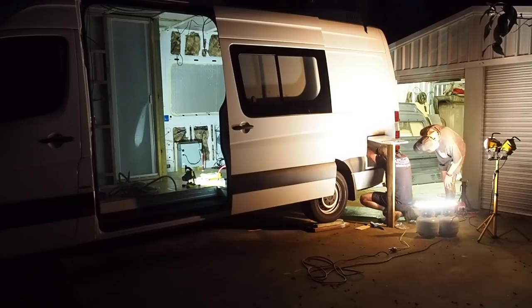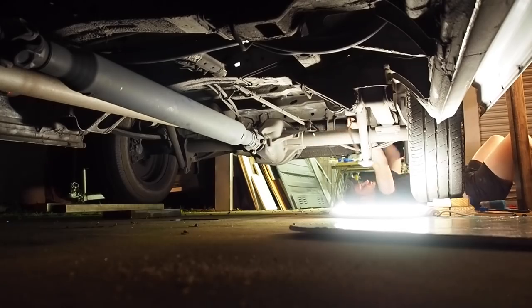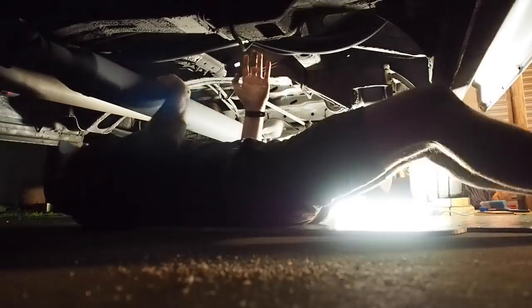So we're getting the holes ready for the pipe work and putting up the regulator. So now we're running all the undermounted gas pipe, making sure that all the pipework is protected, sleeved, and avoids any possible pinch points.